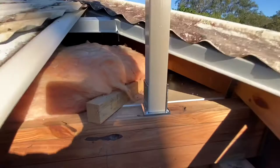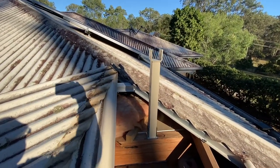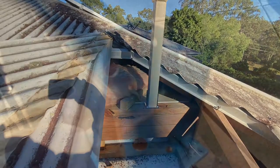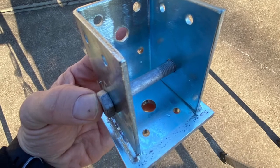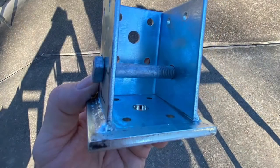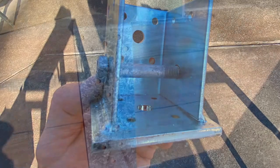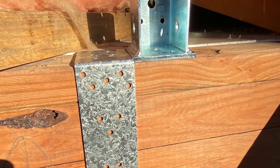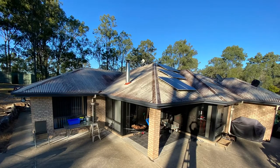That little plate on the left-hand side is a reinforcing plate, used to reinforce your top plate into the house frame or where there's a ply brace section inside the house wall. We provide a 70 millimeter bolt that goes through the bracket into the base of the roof penetration. All that hardware and the installation guide are in your client folder when your kit arrives.